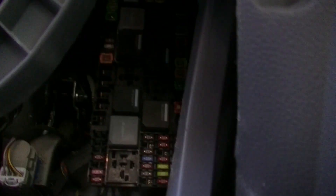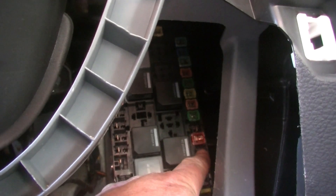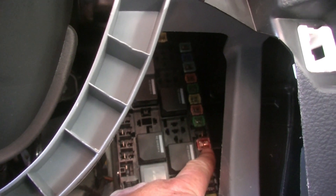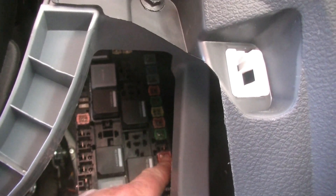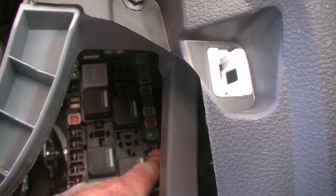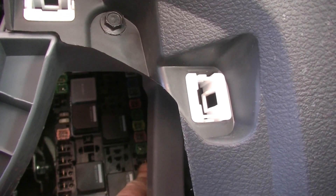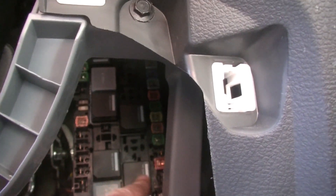I had a lot of trouble getting it out — I think I bent one of the terminals in the process. To check the relay, put your finger on it. Here is R9, and you can see where I have a red fuse in there — that's F40. It should be a green one for 40 amp, but I put a red 50 amp in temporarily. I'm going to get a proper non-chinesium 40 amp to replace it because I don't want to over-stress the system. It feels a little warm, so we'll swap it for the correct fuse.